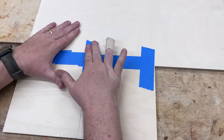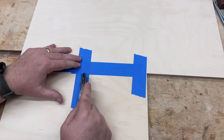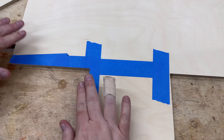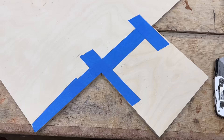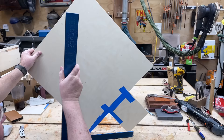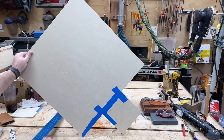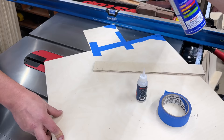I'll run a little piece here — it doesn't have to be fully taped down, I just want to make sure it holds nice and snug. Now if I take off the piece I put on, it's identical to the square remaining on the big square. So if I turn this now and line up this edge with those two corner points, I now have the geometry of a perfect 45-degree angle — just done by rotating it and putting it to those two points. That's a perfect 45-degree angle, far better than what you could make by just grabbing a tool and drawing a line.